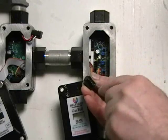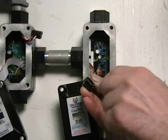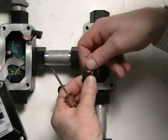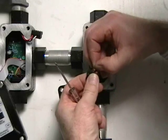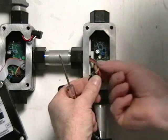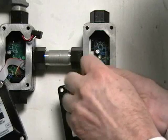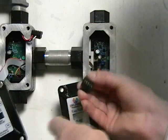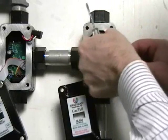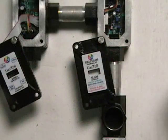The 5-conductor cable is to transmit the 4 to 20 milliamp signal and the RS-485 communication between the detector and the accessory modules. The remaining 2 wires will supply the plus and minus DC power. The units require 9 to 42 volts DC. Both the top socket and the bottom socket are identical, and the plug can be plugged into either end, but obviously the socket closer to the entry point makes more sense.